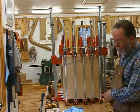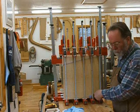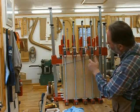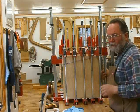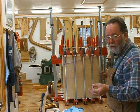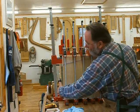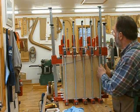Here's the entire glue-up. You can see I put little pads on the bottom of the clamps — just a little piece of paper towel — to give a little more padding to the already soft plastic on the clamp. We seem to be holding very well. There was a little difficulty with the back caul along the side, as it's such a steep angle it had a tendency to slip. I discovered the biggest slip was where the masking tape was attached to the caul, so I removed the masking tape and it's holding pretty well. Mostly the dominoes are going to give us the rigidity we need in this piece.